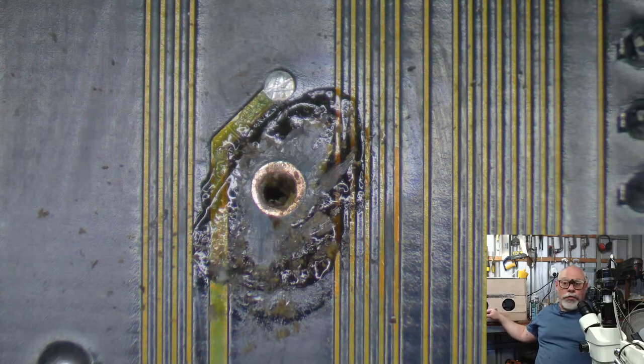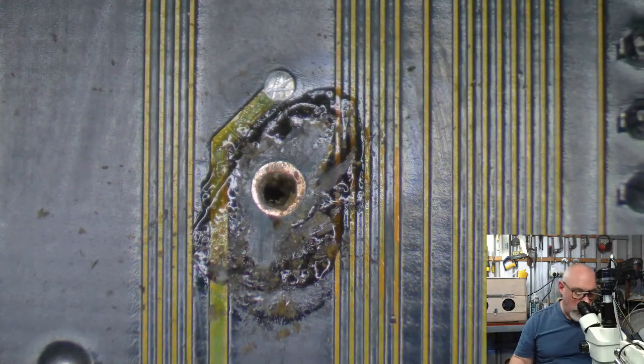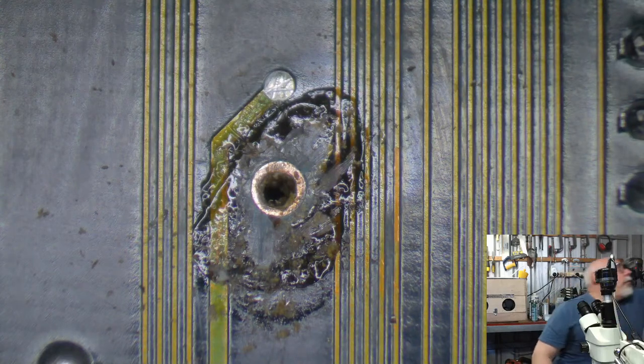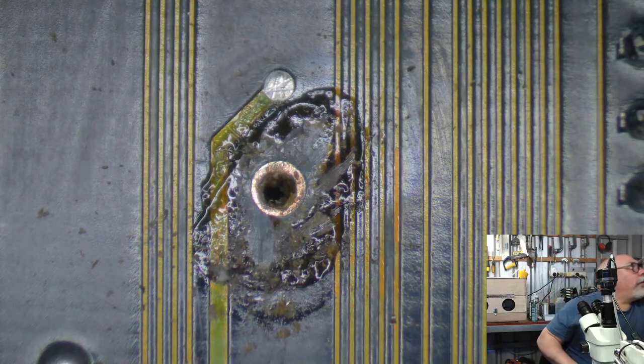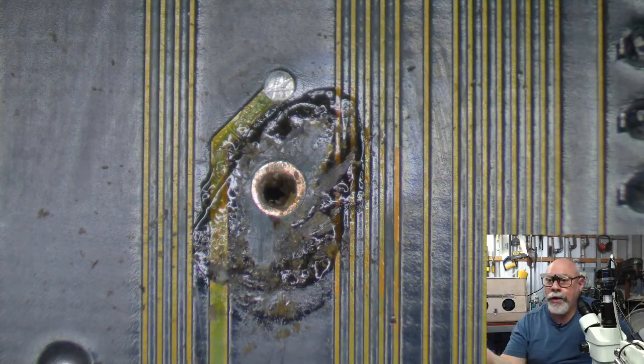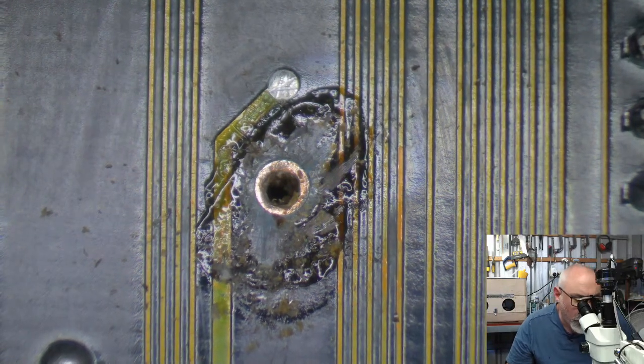So I initially thought it was just they were made like garbage, and they are, but they were melting because they were running for too long without the transducer attached to the bottom of the tub. If the transducer is just hanging there, it causes that transformer to melt, and then I have to rewire it. But I've got pretty good at rewiring them now, so if it happens again, I can do it. And I've got the right wire. This is the transformer wire here, 0.8 millimeter. I have to wrap about 4.1 or 4.2 meters of the stuff around the thing. But got it working.